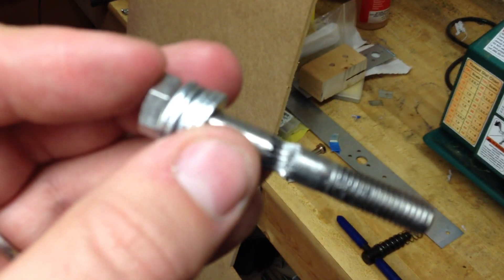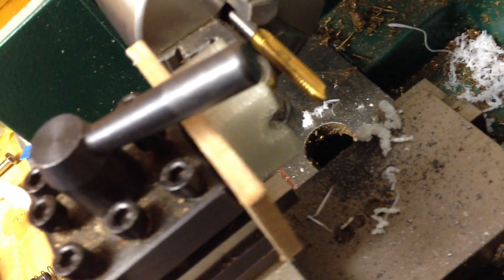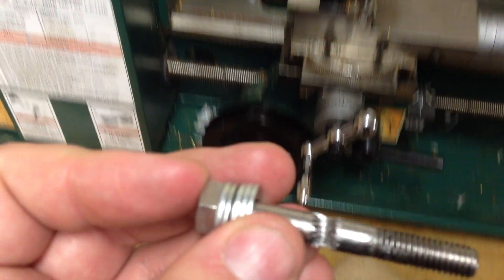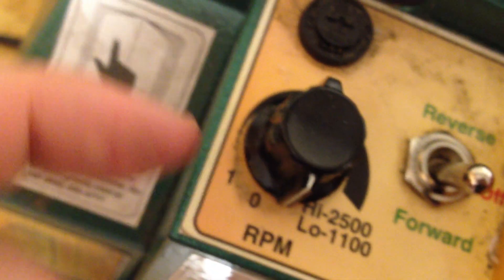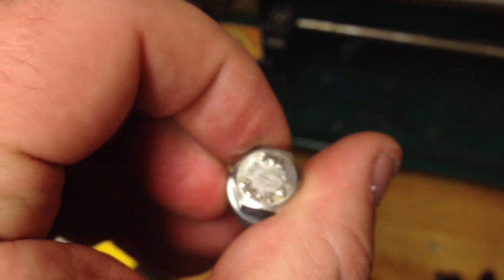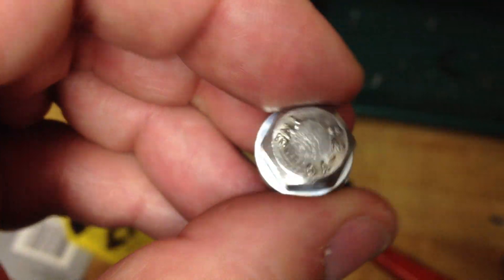Excellent. 60 millimeters long, made it on my lathe with that piece of wood there because it was banging back and forth otherwise. Turned it in 56 notches from the point of initial contact. Lots of tap fluid, very very slow. I didn't have it past maybe here at most. It would turn around and I'd wait — every time I moved it in two or three or four notches, I'd wait for it to go around a full turn or two.